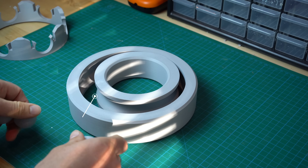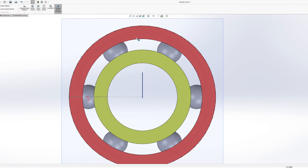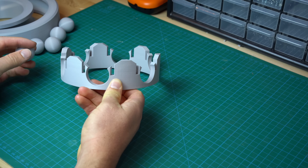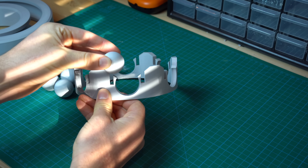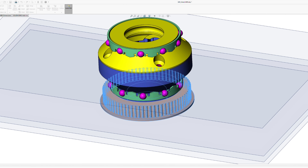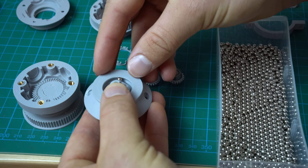If you nudge the inner race over, there's exactly one ball-diameter of space to fit them into the race. To keep them from falling out, you align the balls equidistant around the circle, which prevents the inner race from moving up, down, left, or right. The cage keeps them equidistant — it's designed with passive snaps that yield with a little force and allow the ball to snap into position, but with enough room for the ball to rotate freely once inside. These angled faces are created intentionally to guide slightly out-of-position balls back into their cradle. To optimize space efficiency, I designed the races straight into the casing of the differential. Assembling the true-to-size bearings at RC scale became a bit of a challenge.